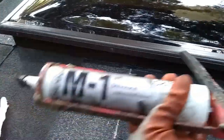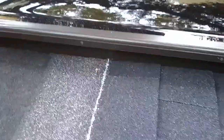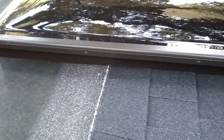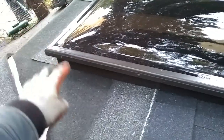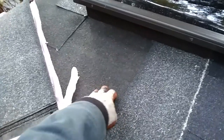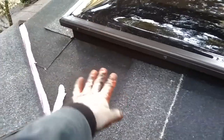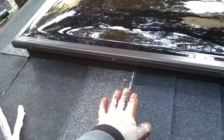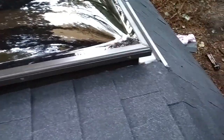This stuff is specifically for metal roofs and has a high temperature rating. When I'm trying to adhere these asphalt shingles to the metal roof, this is the best system I came up with. There's going to be some flexing with temperature changes, but hopefully this product will flex with them. I've got a flashing layer around it already, then a bitumen-based underlayer stuck to the flashing layer, and then in addition I'm putting the adhesive and sticking the tiles in the corner. Hopefully all three of those layers will make it so these skylights never leak.